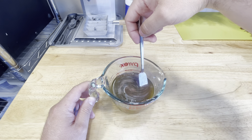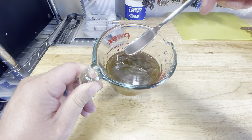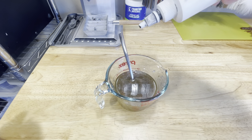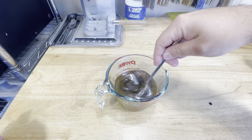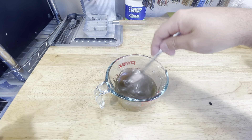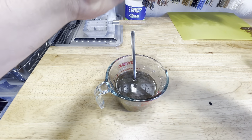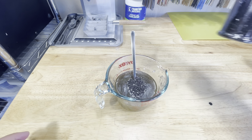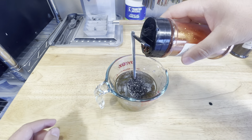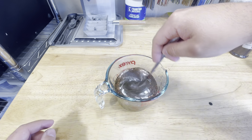I'm going to add just one drop of black. You can see it has almost like a pearly effect, and anything with a pearl or a highlight powder, that one drop of black for the base color really just sets it off. So let's go with one drop of that. Then for flake, I want to add some medium black flake — the 0.040. I'm just going to sprinkle a little in. And then I want to go with some of the small 0.015 copper. I think that copper will complement that crayfish color really well.